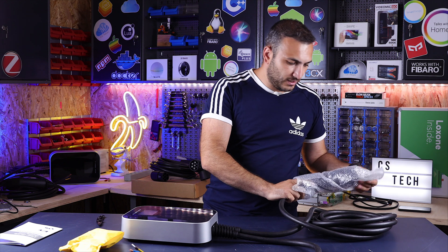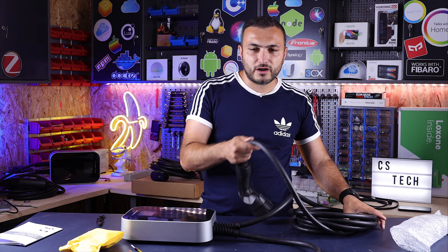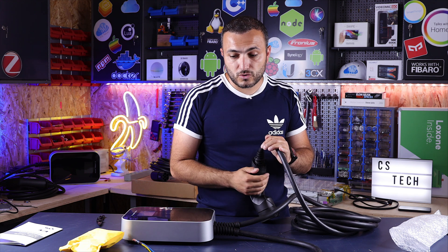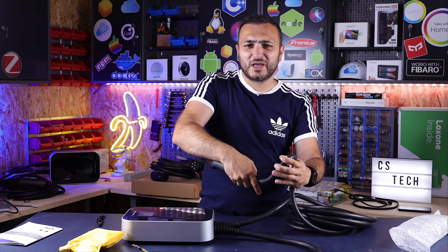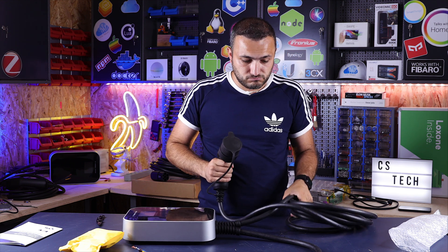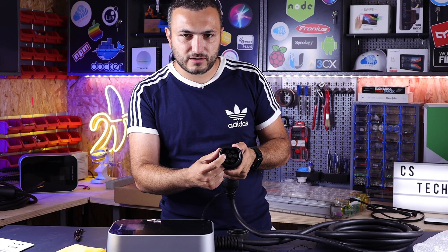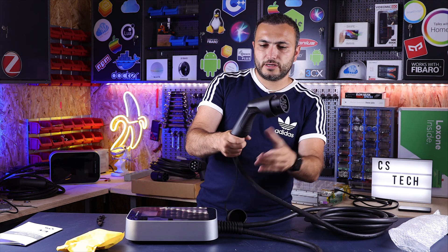This station has a built-in five-meter, three-phase cable. The conductors inside this big cable are six millimeters squared — three by six millimeters per phase, plus earth protection and ground protection. The cable is very big, but also very soft and flexible — you can bend it with your hand. It's five meters long and heavy, I think around three kilos just for the cable. On this end, you have the Type 2 connector. If you live in Europe you have the Type 2 connection. You can see all the pins are filled because this station can deliver energy in either one phase or three phase, depending on your car. The connector is very big and heavy, and gives a very solid connection when plugged into your car.